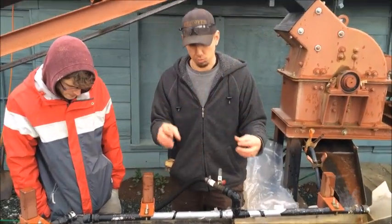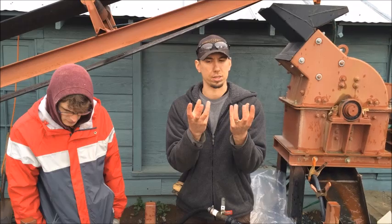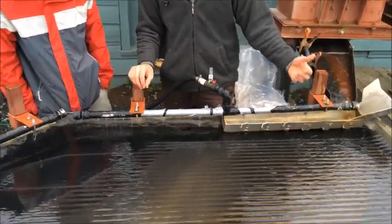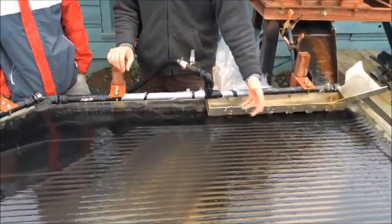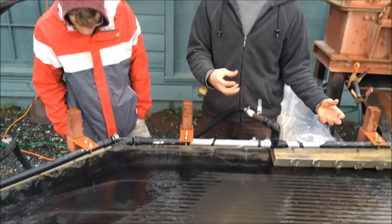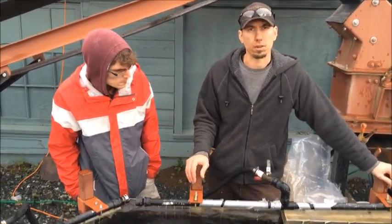The bottom of each one of these grooves, when we cut it with our router, if you look at it under a microscope it's got all these rubber hairs that stick out — it looks like a rubber forest. As the fine gold gets down in that rubber forest, it takes a long time to move up the groove because it's so fine it's got to work its way through all those little rubber trees, so to speak. So the very fine gold takes a long time to move across the table and into the number 1 hybrid.